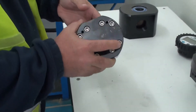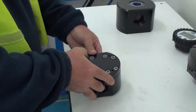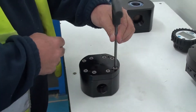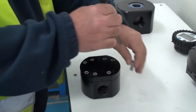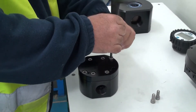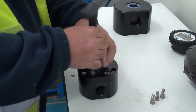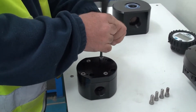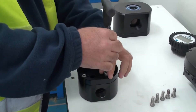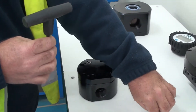The second part is to turn the meter body over and this will expose the eight bolts that hold the meter together. To disassemble we need to loosen the bolts, and we generally do this in a cross pattern — undo one and then do them in a cross pattern so that it comes out evenly. We do a crisscross to remove all the bolts, which will expose the internal parts of the flow meter. Make sure you put the bolts in an area that is easy to get to so you don't lose any.